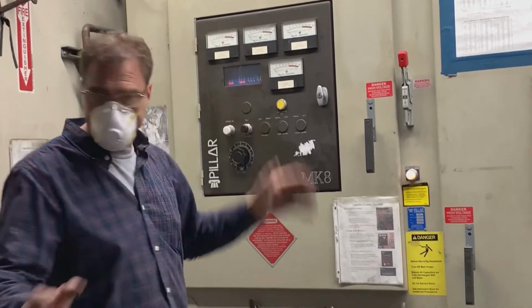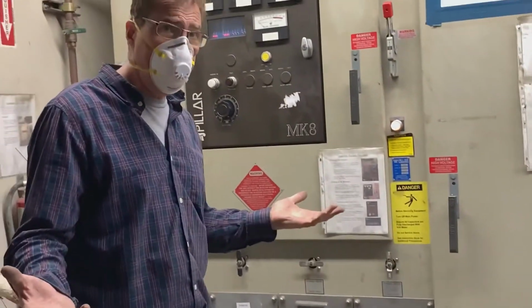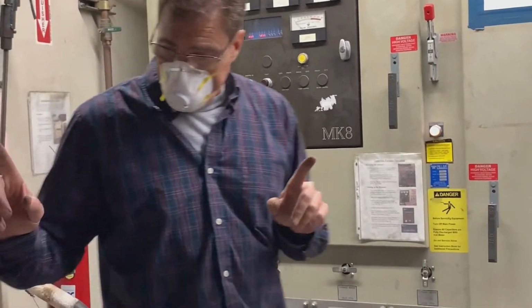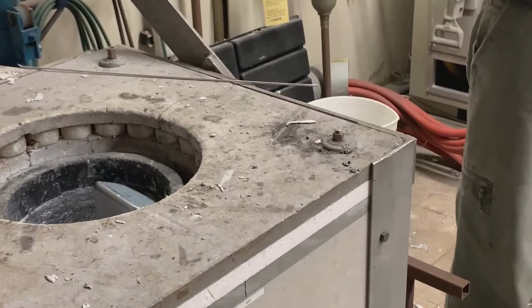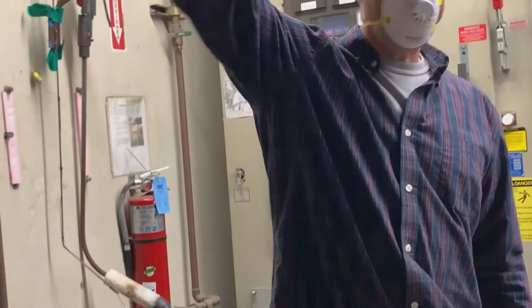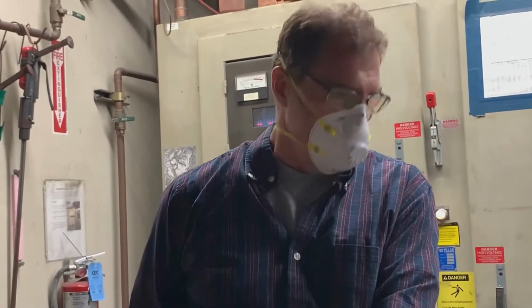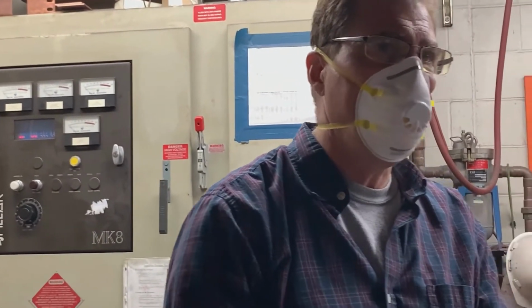Okay, so we're done. We lifted that up and poured it. We're all in there. Okay, all we have to do now: that base cloth underneath there is still hot. So what I would do is, after I poured it, it would be up here. I would just leave it up there, up in the air, away from everything hot. The crucible's down here on the floor after we're done pouring. Just leave it there. Okay?